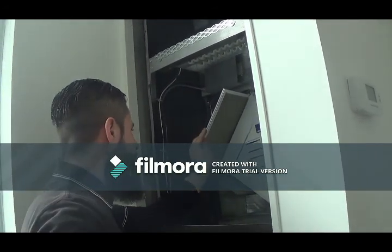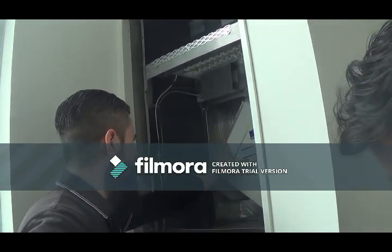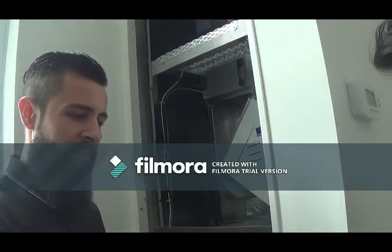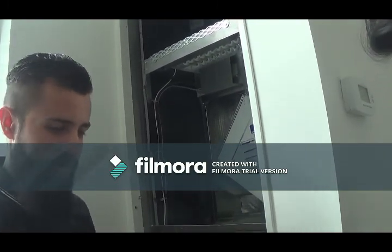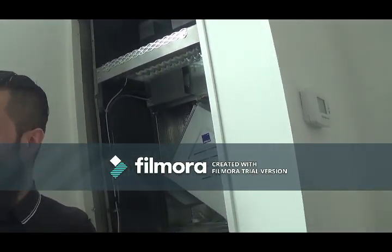Yeah, but this is a washable filter, so you can just. Is it? Okay, but yeah. How do you expect them to have any idea? No, this no vacuum. No, this is a MERV filter. No, it's not a MERV. It's washable, sorry. It's covered, the dust is making it look like, oh okay, so it's like a pleated filter. It's not. Okay. So you want to vacuum it or what? Correct, yeah. So both the core and the filter are vacuumed.